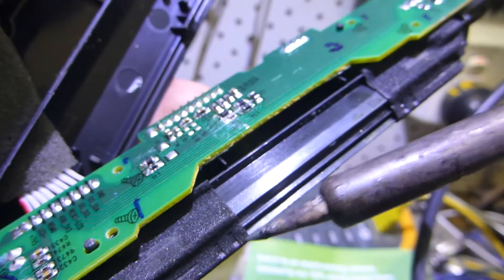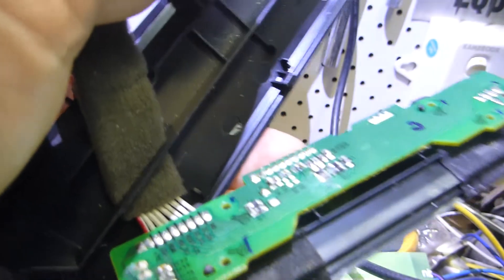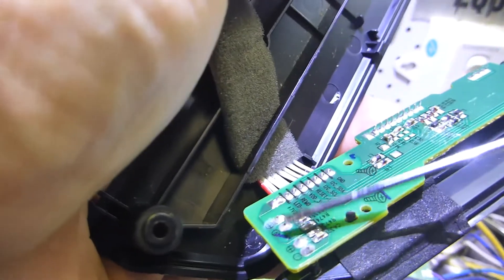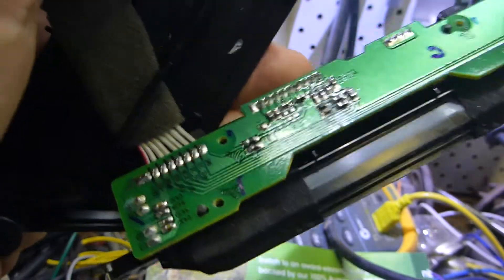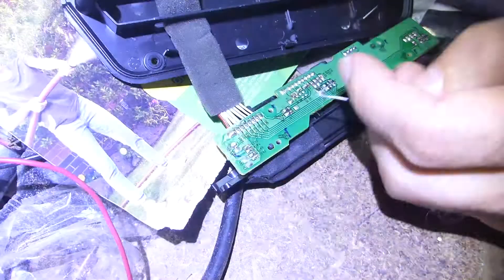Out in the shed with my trusty soldering iron, I'm going to resolder all these little pin connectors along the back here. Often if you get a dry joint in here, and I'll resolder the power supply pins too - often if you resolder these you can make good a crappy connection. This process of reflowing solder is pretty common and really useful on ribbon cables and components like that.